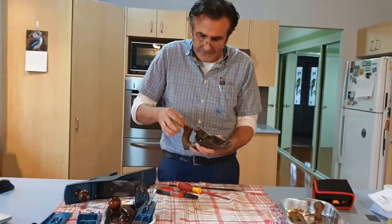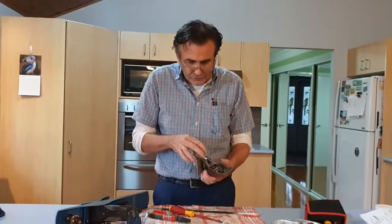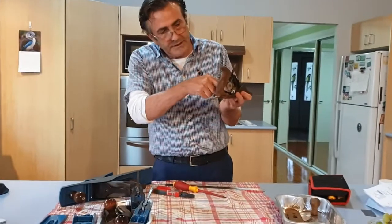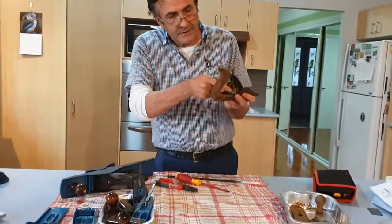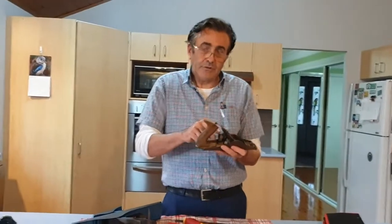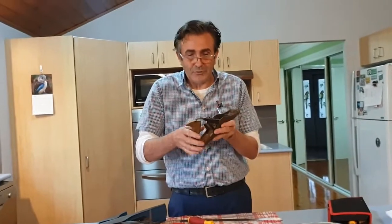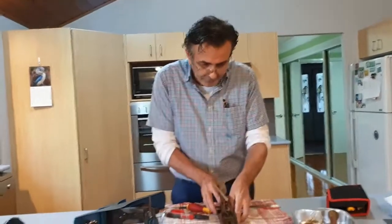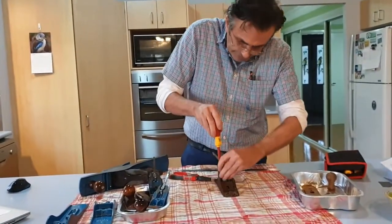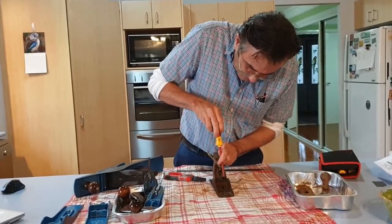We'll take the frog off here. You can see that the lever for the lateral adjustment on the frog is nice and loose. There are two screws here — there's a retaining screw in the back. And you've got your movement to raise your blade up and down on this handle. Of course, it's a left-hand thread, so it's not lefty-loosey and righty-tighty — it's the other way around. Just remember that when you come to take it off.